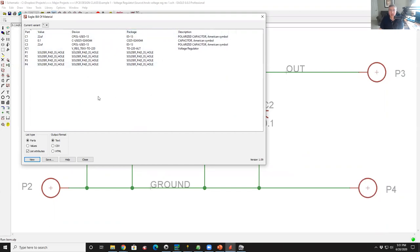The answer is kinda. So if you're going to an assembly house, could you hand them this BOM and would it be sufficient? There's a body of work that needs to happen to actually map this into specific purchased parts still at this point. So sometimes if you're very explicit about the part you put in your schematic, like I want a PIC 18F8722-IP, there's a specific part in the universe, well, they make a million of them, but that part number will show up and directly maps to something you can buy. But if I put in 0.1 microfarad capacitor,